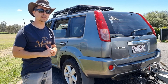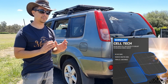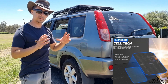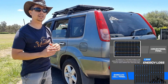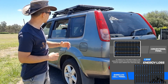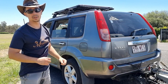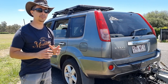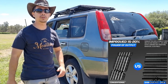The second thing I like about this panel is the fact that it's a shingled panel. A shingled panel is wired in parallel, and because of how it's wired you don't get the problem with other panels where a bit of shade on part of the panel drastically affects the power produced. With this one, being shingled, you can have partial shade and still get way more output. It is very efficient — a shingled panel produces around 15 to 20% more power than traditional panels.